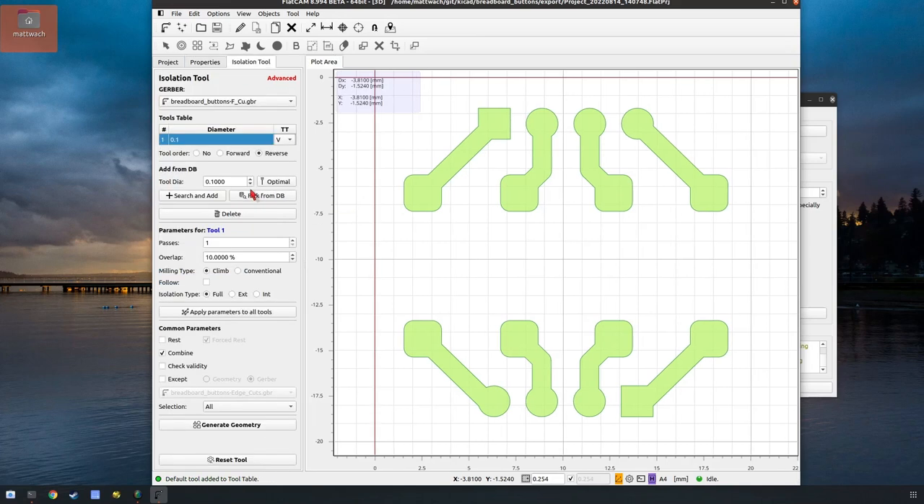Through experience, I found what I like to do is just say custom bit and put in the width that it's going to cut. You have to pick a width that's less than what you picked in KiCAD or it will refuse to make some traces. I picked 0.4 in KiCAD so here I'm going to pick 0.39. Passes are the number of times you want to go around — I usually pick 3. You could pick 1 and your cut will be quicker, but it'll be less forgiving to solder and there's a higher chance you might have a short.